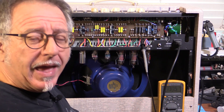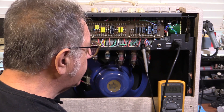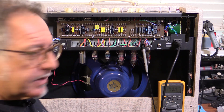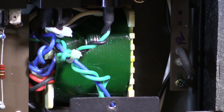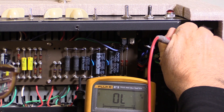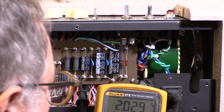When we have no power at all, we've got to start with the power supply. I can see there's a MOV — metal oxide varistor. It's this little fella here, a black disc. The job of an MOV is to act as a surge protector before the primary side of the mains transformer — if some surge comes in, it breaks that circuit so it doesn't damage anything further on. Input side of the MOV reads 235 volts, so the MOV's good.